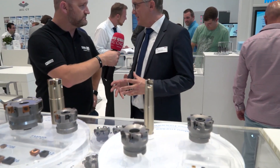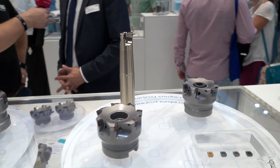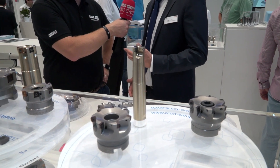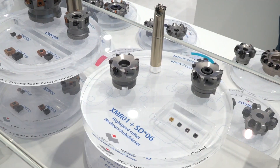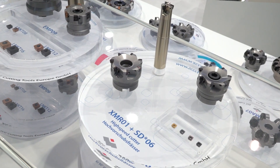So Norbert, you've won your booth here at AMB 2018 and you've got three new products. Yes, we launched three different types of inserts here at the exhibition. The theme is the downsize. We have here the existing tools, it's an existing working series, but we made these inserts smaller, and especially here for this 90-degree square shoulder milling, we have now an additional high-feed cutter insert. So that means you can use the existing tools with a high-feed cutter and we can run as fast as possible with the machines.